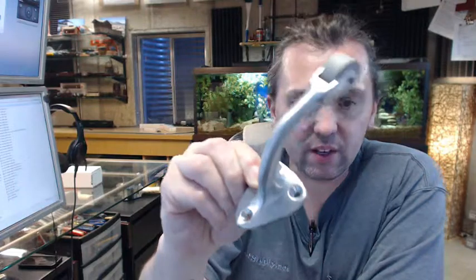Where you see a curved roller stop like this is when you have two walls on an inside corner. On wall A you will have a left-hand door, and on wall B you will have the same left-hand door as well. So you have a door that swings over this way, but then the other one comes into its space — and the curved roller stop is appropriate for solving that problem.